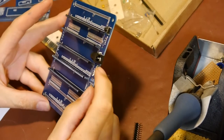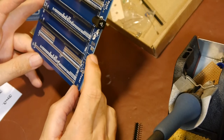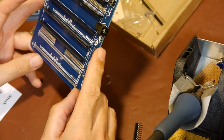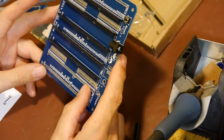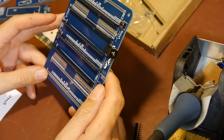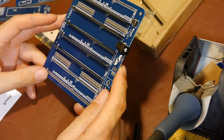I have to get out the big solder for this one. There's a hole here marked U1 with a couple of capacitors next to it - that's going to be a 5V regulator. But it looks as though the regulator is optional with this kit, which I think is probably not a good idea. This is going to be 5V, and they've given you a power jack - 5V isn't a natural power supply from a wall adapter.